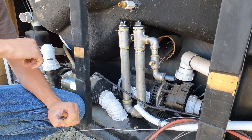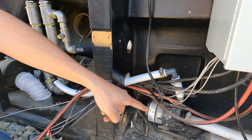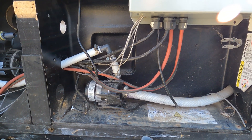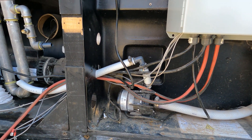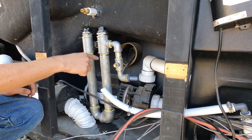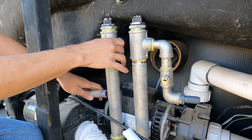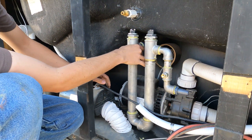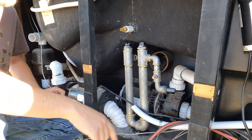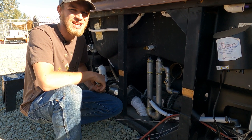This is the version 2. This is all stainless steel 304 series so we don't have any issue of rust there. There's a pump right over here that sucks cold water or relatively cooler water from the spa - and keep in mind we're cleaning all this stuff up in terms of wires and whatnot - but that then sends the water through here where it'll go through this heating element, cycle through, and then this other hose that's not connected yet will return the water back to the spa. Galvanized pipe was not the way to go because the chemicals in the spa rusted that out in no time flat.